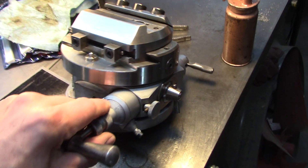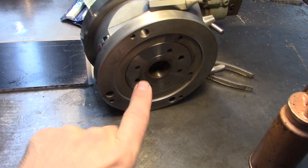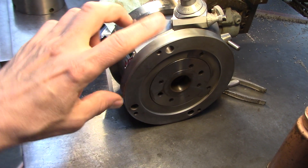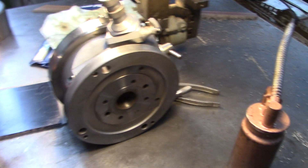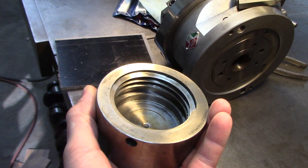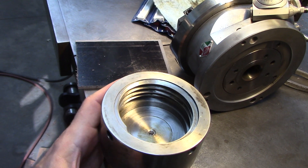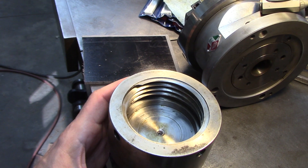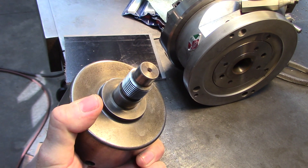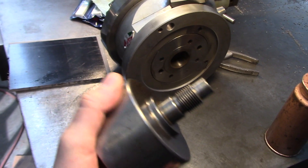This head is like 20 pounds. It's got a 24-millimeter thread — I believe — with a 25-millimeter spigot. This is the body that you hold rigid. There's an adapter that somebody made — looks shop-made, cooked up on the lathe — and that screws right on the nose of the Pratt and Whitney jig boring machine. The register is one and three-quarters of an inch, so it's a good wide register.